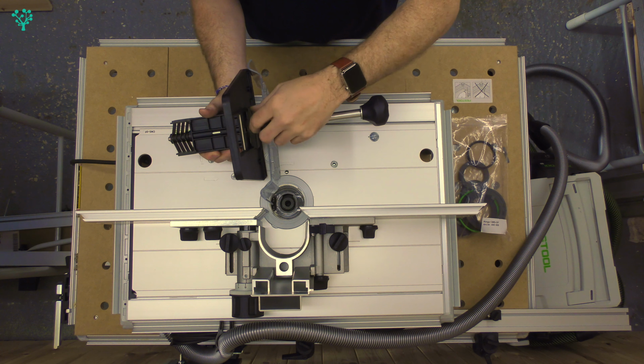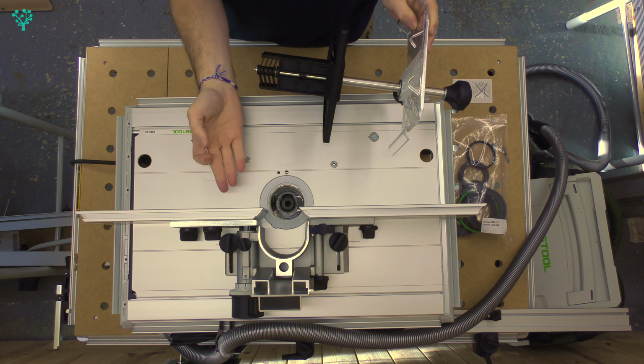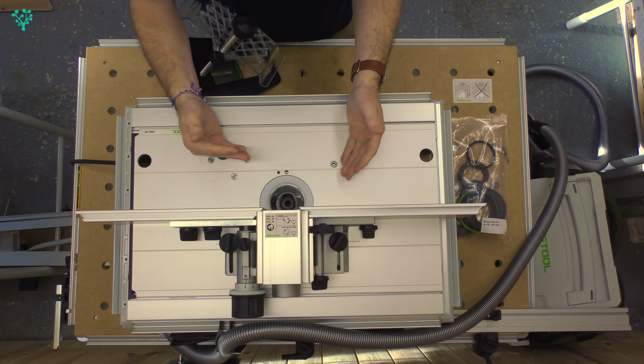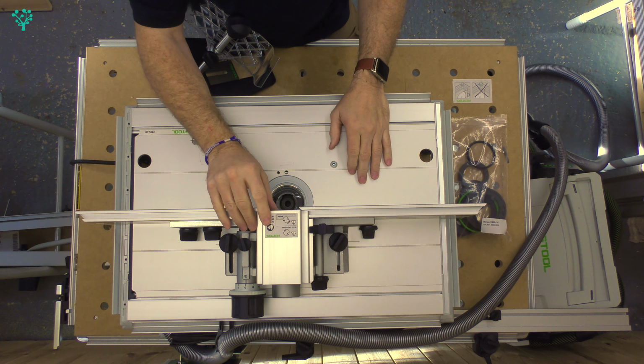The second thing is, I'm not sure if you can see it, but that says a spring design. You see that going up and down? That's a feather board, and that will put weight and pressure down on your workpiece to make sure it stays flat onto your bench. Similarly, on the plastic one, these arms here and these two springs inside do the same thing to make sure that the workpiece stays flat against that area there. That's why I said before that this needs to be able to lock into position with that clip. If not, that pushes up because that clip's not securing it, and therefore that will take the downwards pressure off it, and you're not going to get a consistent cut. So it's important that that locks into position,